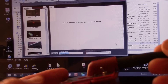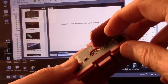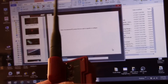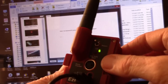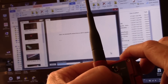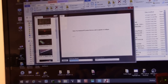Now let's update the firmware on the JR module — the EasyUHF JR module — so we can make it compatible with the nano RX. This one also has a high-low switch, so we need it in the high position to do the firmware update. Then plug in the USB cable. If the light isn't flashing, press the button and then plug it in — now the light is flashing, which is what we want.